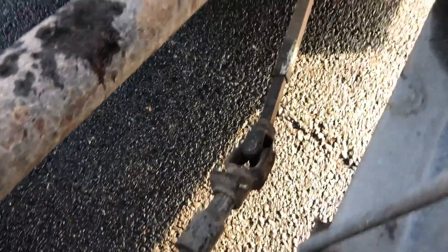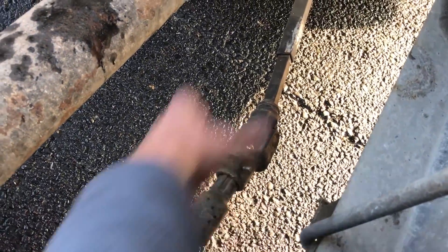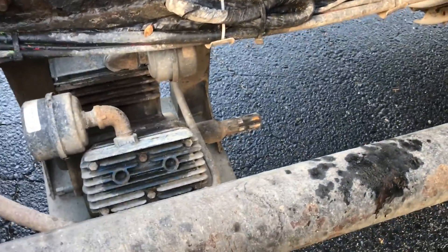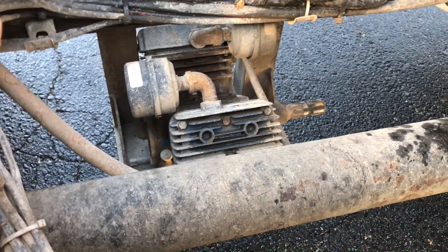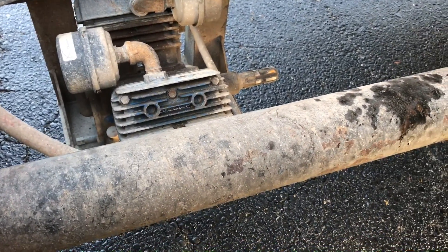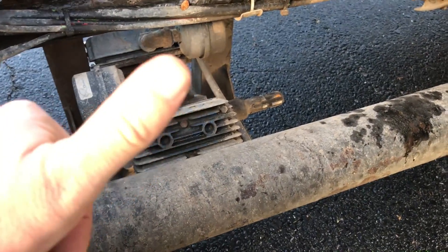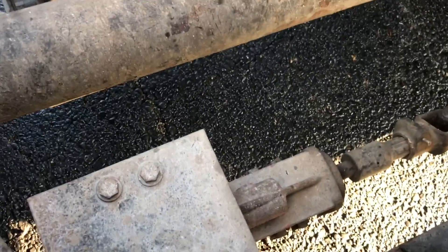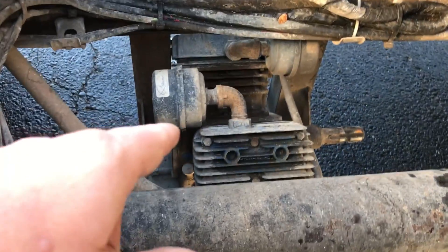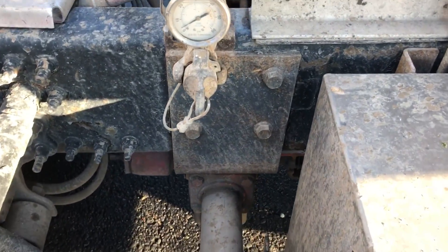I've got a split shaft — there's a button right there. I press the button and the shaft slides off, then I can move it over to the air compressor. The downside is I can't run both the air compressor and the product pump at the same time. I don't really have a need to, but occasionally we get really thick product and usually the customer has air, so we'll air on top while using my pump to pull it out. The Quincy air compressor hose comes over underneath the catwalk and comes out here, so everything's on the same side of the truck.